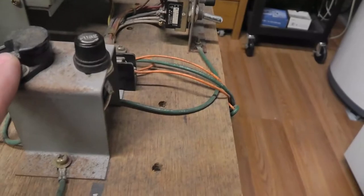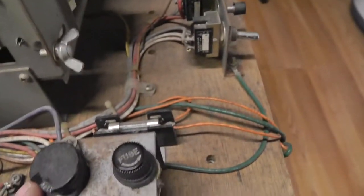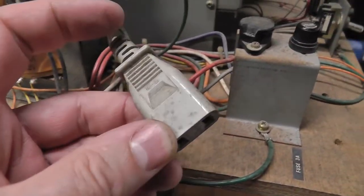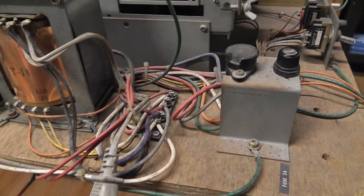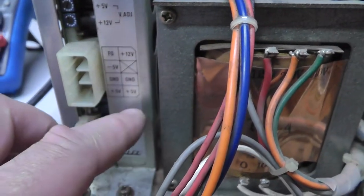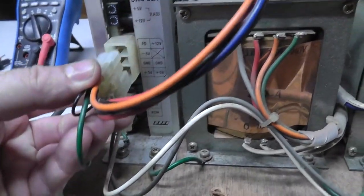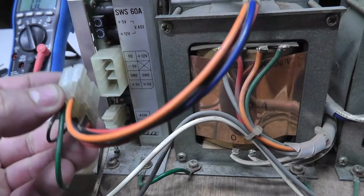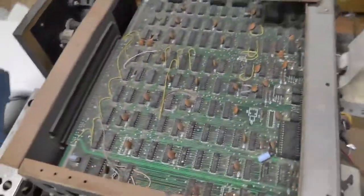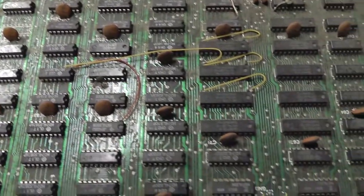There's a fuse marked 117 volts. I don't know exactly how to change that if it's a switch or just how it's wired up. The monitor is 110 volts and the degauss wire is also 100 volts. The switching power supply puts out 12 volts, negative 5, and two plus-5 outputs. I unplugged the connector to test it. I think I did power this on once and got a blue screen but I'm not sure. We can see the 5 volts there — it is still filthy with tons of little jumper wires, but they all look intact.